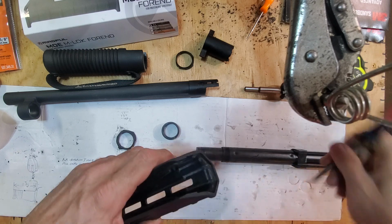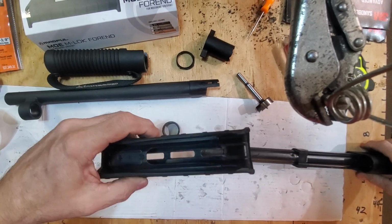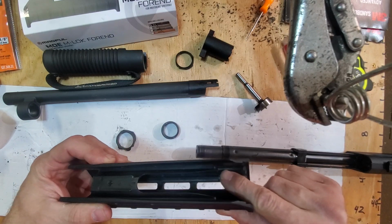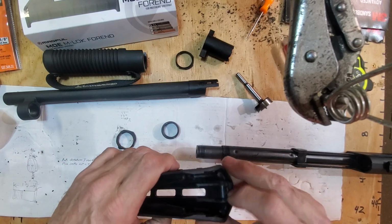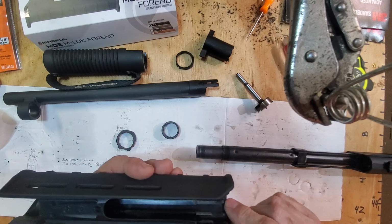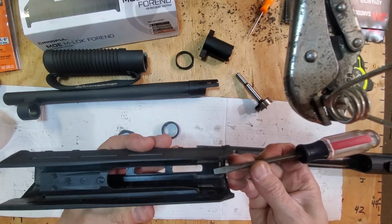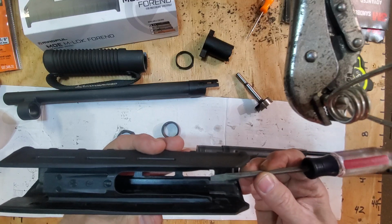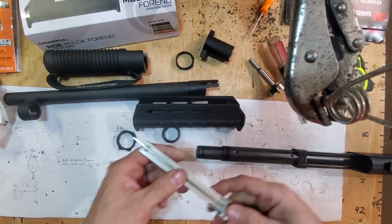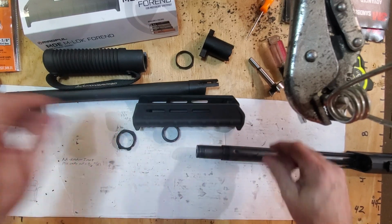And I did the same thing on the other end. It's towards the receiver. That would be this end. And you can see there's these pieces here. So you don't want to take this all the way down. The stock, when this comes out of the box, you can see here, that's about where it's built from the factory. And then I took this much more out. So I did the same thing on this end. And to get my depth, I just set this at 5/8 inch, roughly.